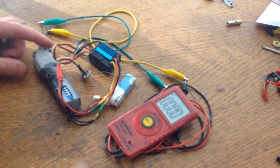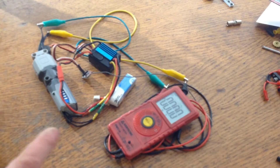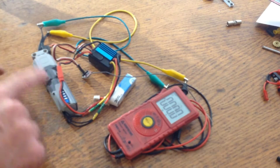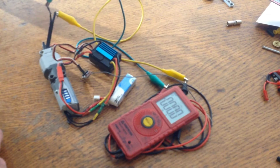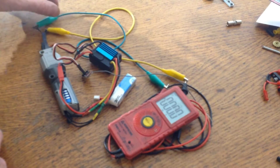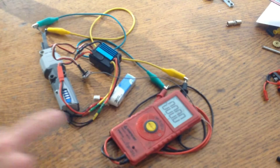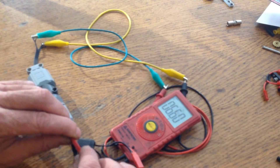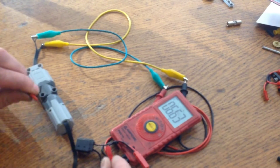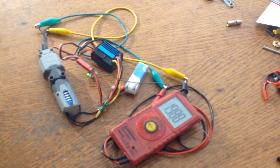Since the characteristics of these motors are so different, I want to test the total power output. So what I'm going to do is use one motor as a generator and see how many volts the brushless produces compared to the original LEGO motor. The LEGO motor is producing about six and a half volts, and the brushless motor is producing about 20 volts.